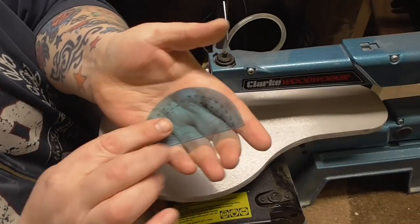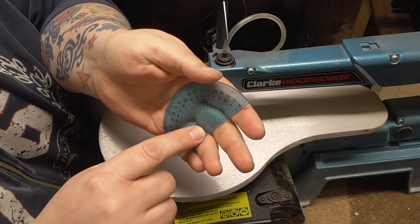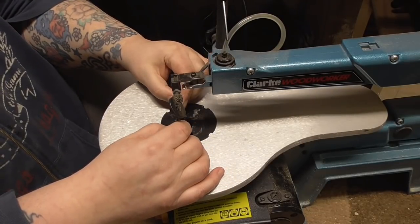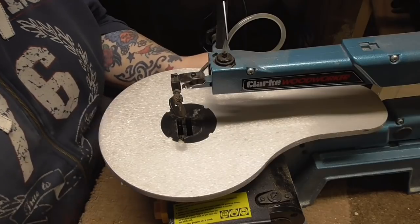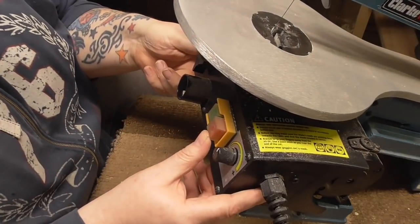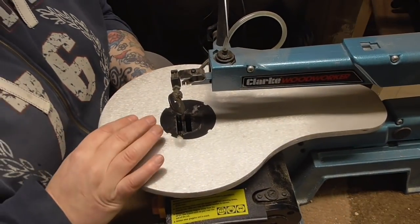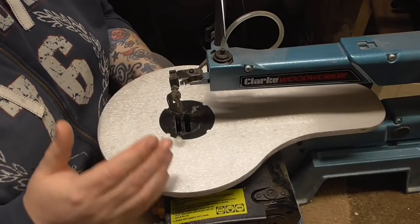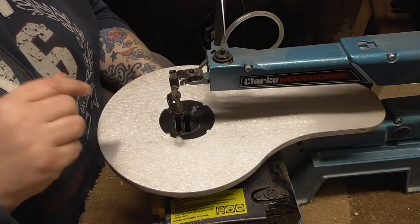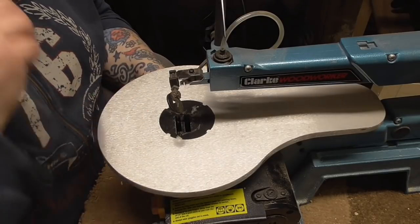as you can see, you've got your 90 degree, there's a black line. If you line your blade up with that mark on the back of the blade, your work shouldn't be far out. Just look at the settings. See, if I look at the settings on my machine now to where I've set it, it's just past zero, which is 90, so it's about 92 degrees on the settings on the machine itself, whereas I've just set it to 90 degrees.